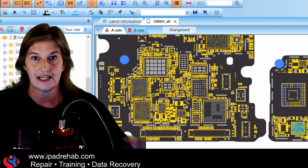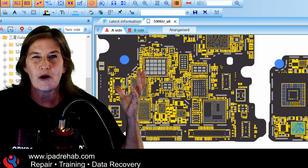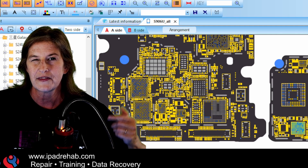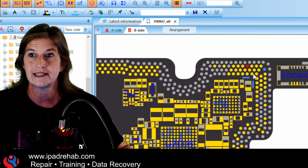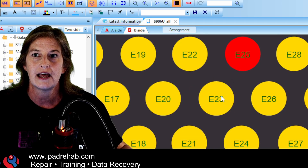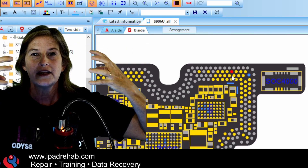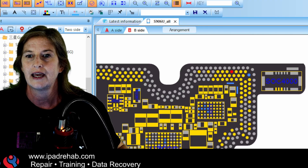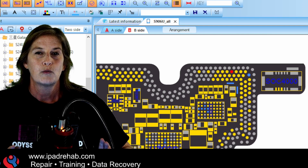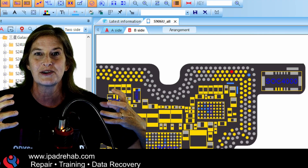So what I did first is I took both of those chips off the board. And guess what? Those two lines were still shorted together — but where? The only other thing I could think of is that they were shorted together inside the layers of the board. Flipping the board, we can see that the VBAT sense and VBAT ground also go here to E25 and E23 — just two little balls that connect the top board to the bottom board. What if there was a little piece of corrosion connecting those two balls together? I thought there was some chance that might be the case, but honestly I really didn't believe it.